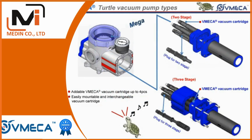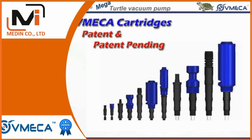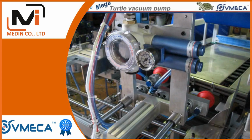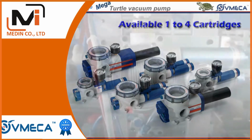Okay, so here we are showing you the turtle pump disassembled. The turtle pump generates vacuum by using these Venturi cartridges. The incoming compressed air pulls vacuum across the Venturi that creates vacuum in the chamber. In this pump you are able to install as many as 1 to 4 cartridges, depending on your application and the amount of vacuum to pull.